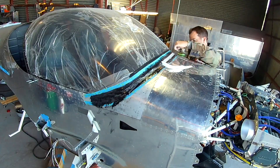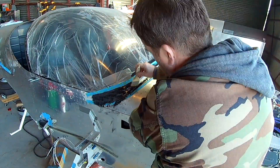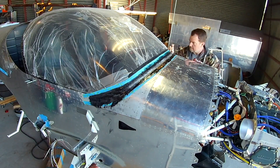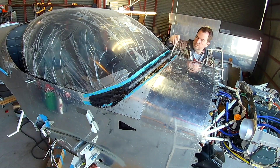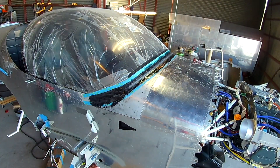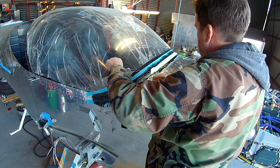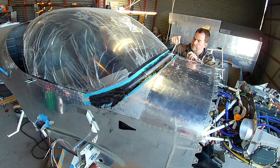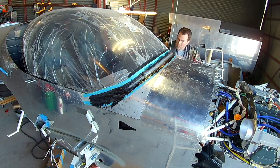Order of operations: all this cloth now, we're going to let it dry for about a week. Then we're going to go in and start sanding. If there are any low spots, big bubbles, or big defects, we're going to use more cloth and resin to patch those in, because the cloth is for strength — we need this to be very strong.